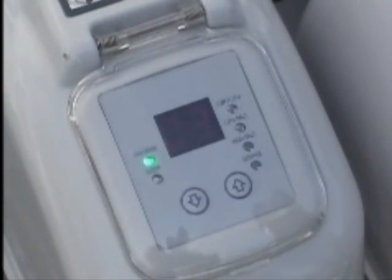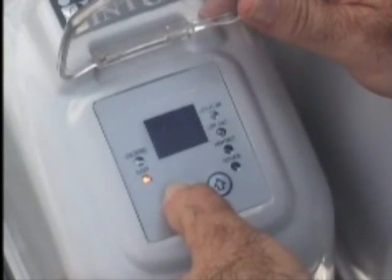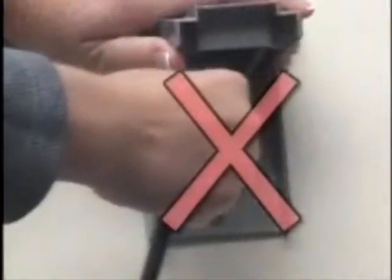When the chlorine cycle finishes, the green LED will turn off and the sleep LED will turn on until the next cycle. The unit will show code 93 for one hour. Press either button to view the LED code if desired. Do not unplug the generator. It will automatically start chlorine generation again 24 hours later at the originally programmed time.